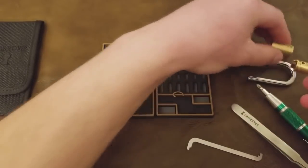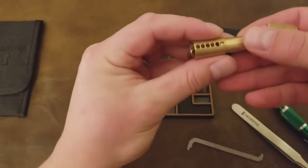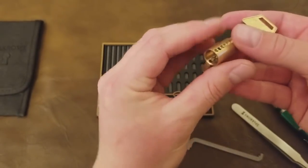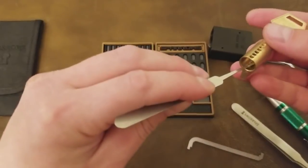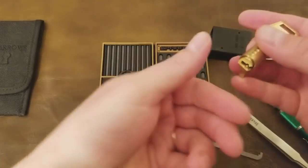Now I'm thinking about it — okay, there's the front. I kick it to 90 degrees again, making sure to angle it just a little bit so those key pins don't dump out because of gravity, and I'm sliding the plug back in. Really only one pin fights me — you see I reach in there and just kind of push it down out of the way.